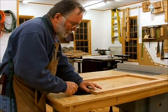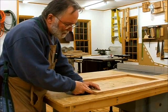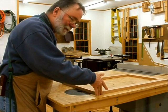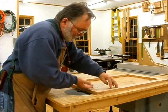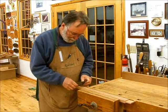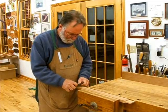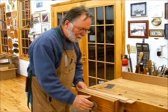Here's a dry fit of the bottom. I purposely made these pieces a sixteenth inch wider than needed so there's a little tenon sticking out on one face and recessed on the other — that way when I clamp I'll get a nice tight pull of the parts. For the top, the tenons fit just a little tight, so I'm using a cabinet scraper to pare that tenon down just a hair.